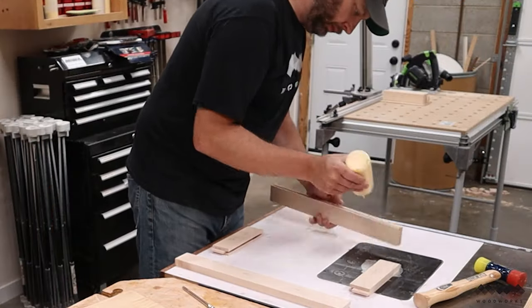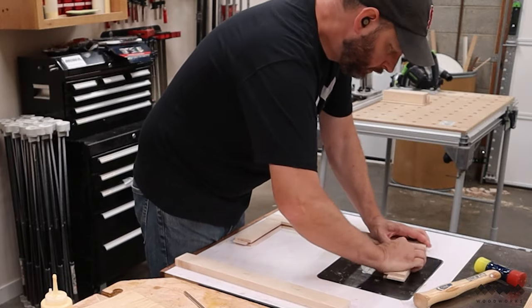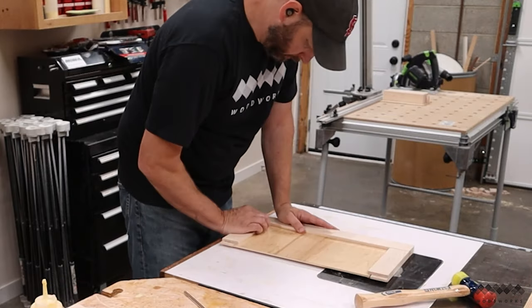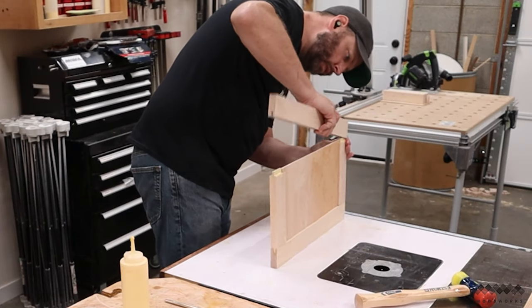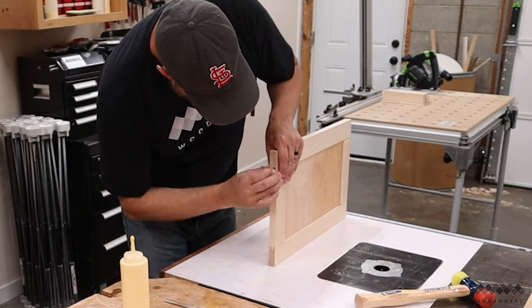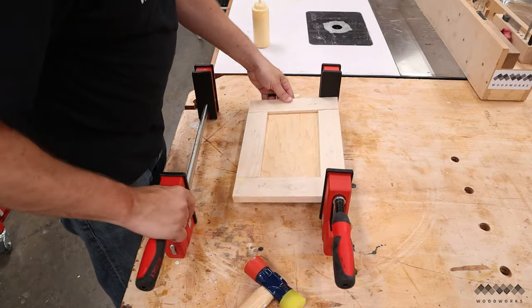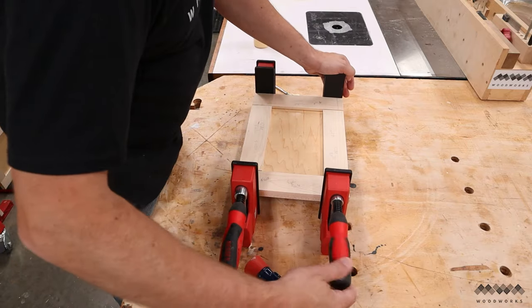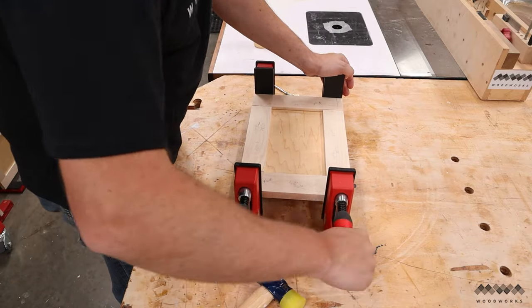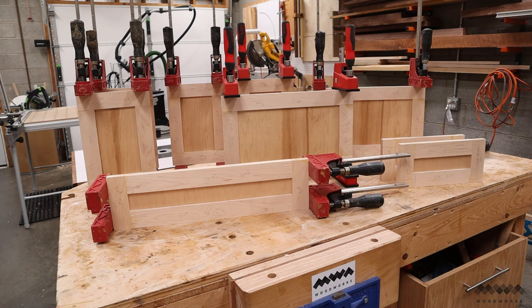Building these is really simple. I just add glue to where the tongues will be and add the top and bottom pieces, then slide the center panel into the grooves and add more glue to the other side. I then add the fourth side and make sure everything is lined up properly before adding clamps. One reason I love this method is that there are no fasteners needed — just wood glue — and if you cut the joints right, it's pretty much guaranteed to be square when you clamp it up. I just repeat that entire process nine times and let the glue dry overnight.